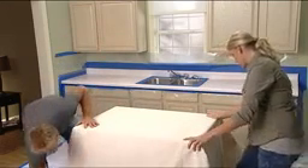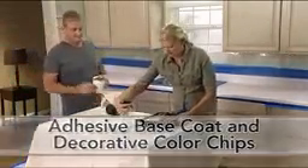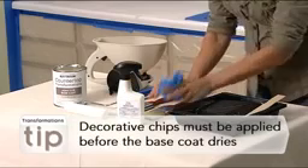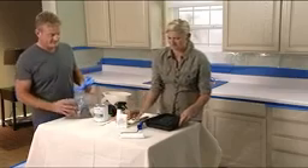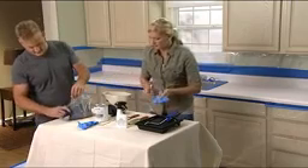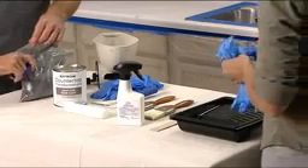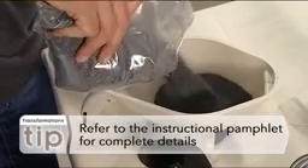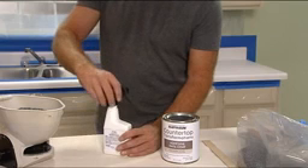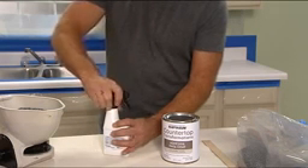Create a workstation in your kitchen to make preparation for the next steps easier. The two next steps must be completed together. It's easier if you can work in a team of two. In this stage, you will apply the adhesive base coat and then apply the decorative color chips while the base coat is still wet. It's very important for the adhesive base coat to stay completely wet until it is coated with the decorative color chips. To achieve the best results, keep your windows closed and your ceiling fans turned off. Keep pets and children out of the room while you're working. Variation in temperature and humidity will also affect how long the adhesive base coat stays wet. First, prepare the decorative chip dispenser by filling it three-quarters full with decorative chips. Adjust the control to setting number 2 and set it aside. Next, prepare the wetting agent by putting on the spray nozzle and gently shaking.